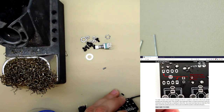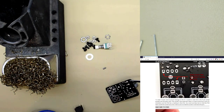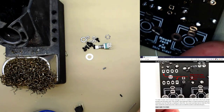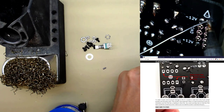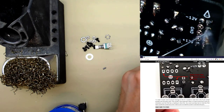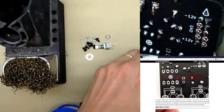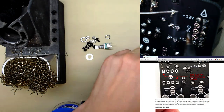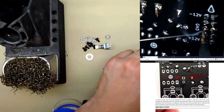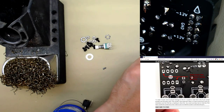Oh, it is flush. Just to make sure it goes in. Now it's flat in, I can just do all the other tabs. Remelting the one I did in the first place, because it wasn't a proper joint. They tell you not to put solder on the iron first, because you need to heat up the joint first. But it's okay if we then remelt it afterwards. It makes the solder joint proper. There you go.